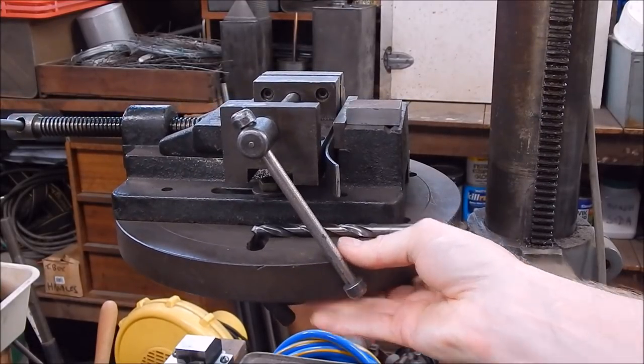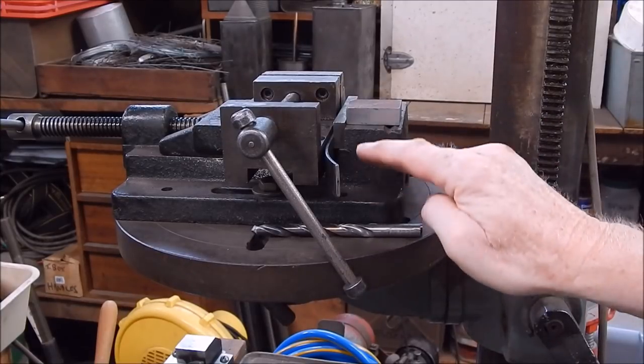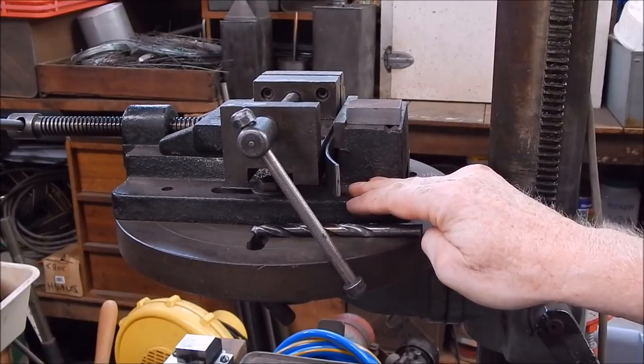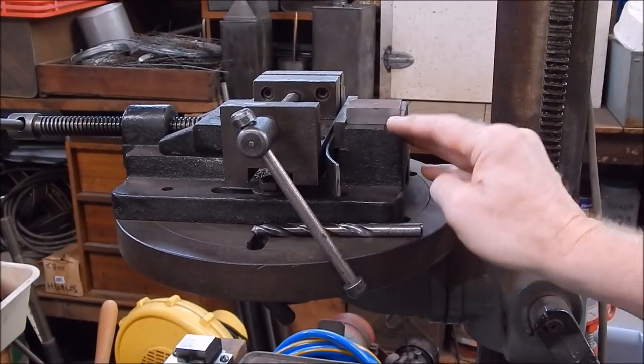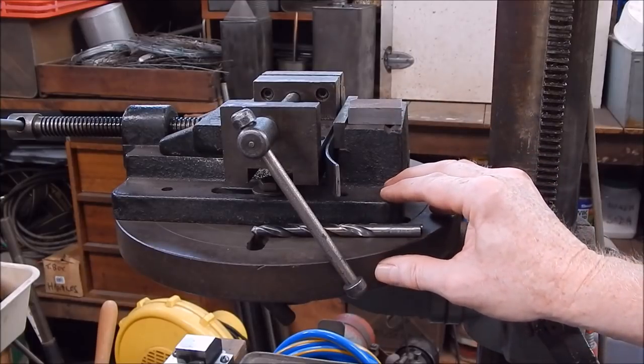Another little tip, if you do use a drill press, naturally always bolt your vise down if you're at all safety conscious. It horrifies me to see the number of people on YouTube channels drilling stuff, holding metal with just bare hands even. If that catches, it could just do nasty stuff to you. But a lot of people live dangerously.